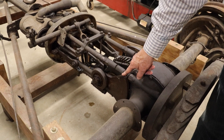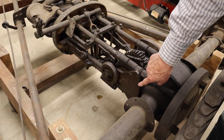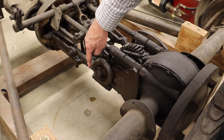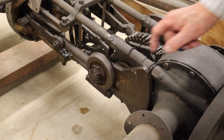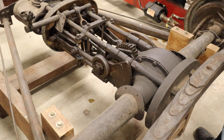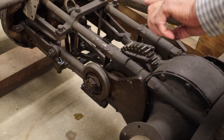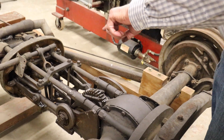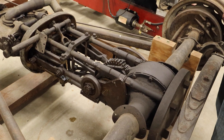What we have here is at least a counterweight which kind of attempts to balance this. You have the outboard crank pin which is here. This one is horizontal, this one is vertical, so these two are at 90 degrees — so they never get stuck at top dead center and they'll always start.